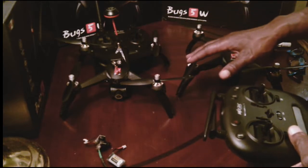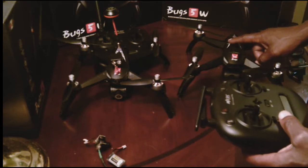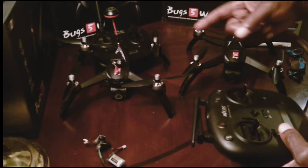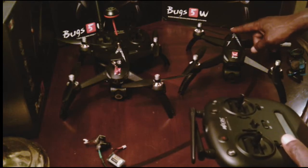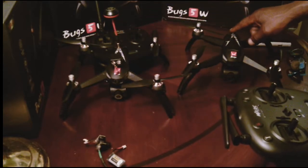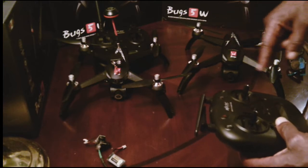things you guys need to get ready, and I'm going to show you step by step how to upgrade your transmitter, and to install an internal camera here, which will be able to pick up on your goggles so you could do FPV flying, because that's what I'm basically into. And I'm going to put an antenna here, put a little SMA just like I have this one here. But this one here is going to be dedicated for the camera here. So this basically is going to be designed for FPV flying.